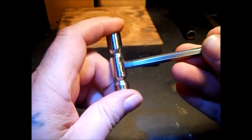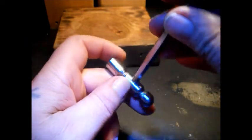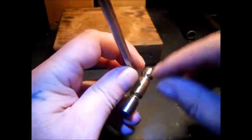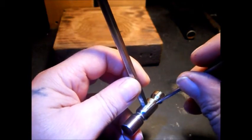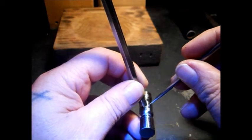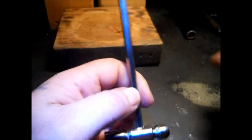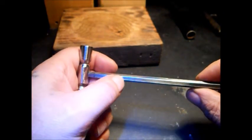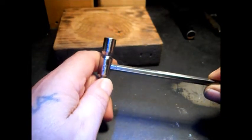If this doesn't seem to hold, I'll either put some epoxy on it or I will drill a hole and pin it. I could drill a hole down there where no one can see it — drill it at an angle that way no one can see it. It doesn't really matter. This is a pretty hard rod — it does drive the oil pump.